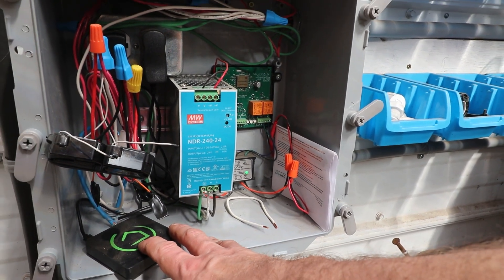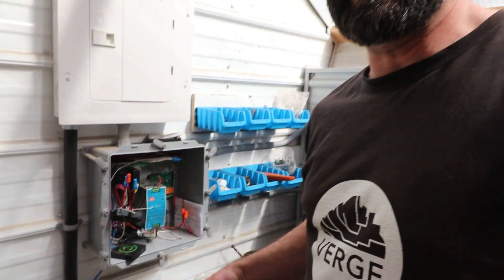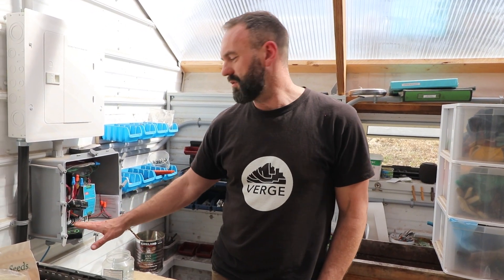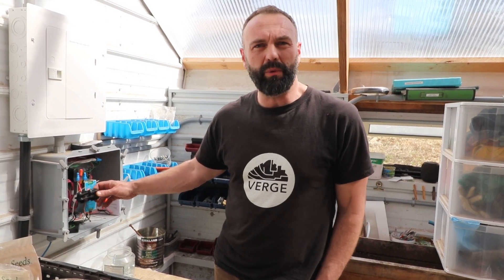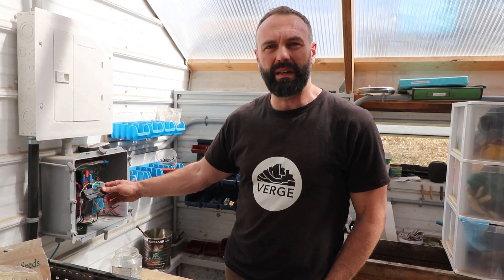This is a fairly inexpensive way to automate all sorts of different devices within your greenhouse, as opposed to getting a custom greenhouse automation system or using PLCs with programming languages like ladder logic — which is really hard to learn — or even having to learn a Linux device requiring basic Python or code. This is really easy to program, easy to set up, and fairly cost-effective. Z-Wave devices are ubiquitous across planet Earth and also fairly inexpensive and easy to utilize.